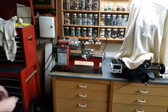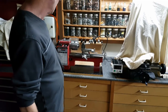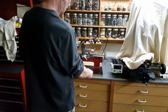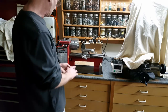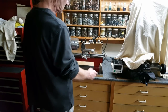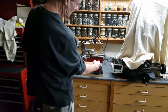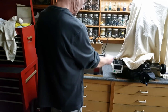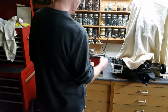I've never shown a teardown of the apron here. I was doing threading and left the power feed in the wrong direction — it was already at max, so I messed up the claw. To get this apart, you remove the three screws on the underside of the black chip-protecting tray — the tray that keeps chips from going into the lead screw. Loosen and remove the screws, then remove the bushing — there are two screws. Slide it off the lead screw, then slide the chip tray out.